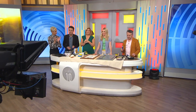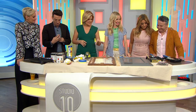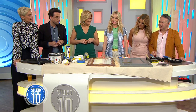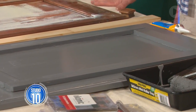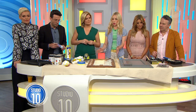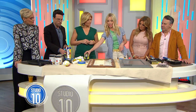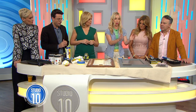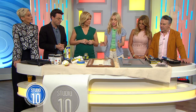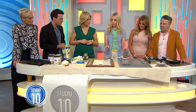We have Australia's renovation queen Cherie Barber here, showing us how to update a kitchen on a budget. She's taken a daggy old wooden door and turned it into something pretty modern. It's almost all about the colour. To recap: clean your cabinet first, then sand, then apply the undercoat. Use a palm sander — it's much quicker than by hand. The undercoat primer helps your laminate paint stay on your cabinets for years and years. If you skip that, the paint will peel away. Then two coats of laminate paint, sanding in between coats.